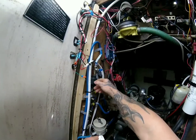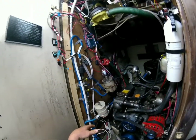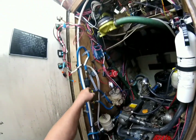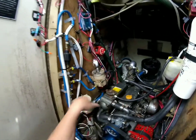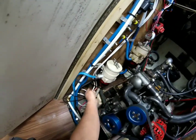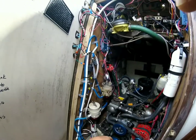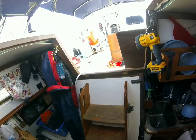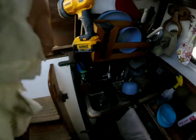It's just a little fuel pump I put in there with some fittings. And you can hear it now. It's sucking fuel through here, up there, and it's going back into the tank. Then this one here is just sucking from the tank right into the motor. So you can see there's air in there. So I'll probably purge it for a while and run off of this one. Hopefully that'll purge all the air out. Fuel and running the motor on two separate loops. And if it stalls out again, hopefully I can just switch them.